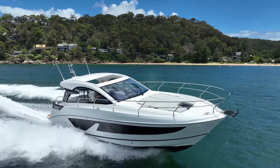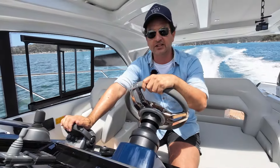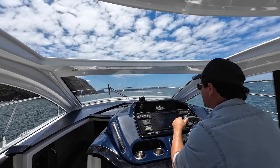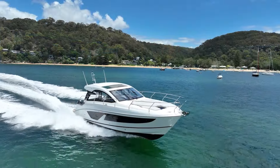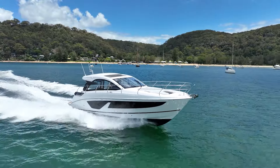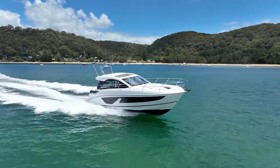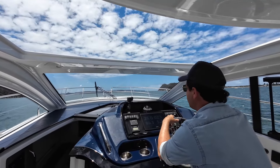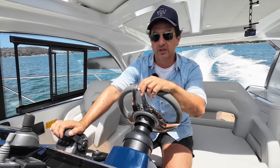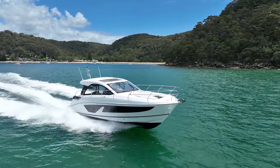I'm still doing this from the seated position. Let's increase the speed. From 23 knots at 70 litres total, I'm now getting up to 3,060 revs — let's get it to 3,100. It's summer holidays so you'll see my head moving all the time with people coming from all directions. That's giving me a speed of 26 knots. I'm at 3,150 RPM — 26 knots. Let's go to 3,200 revs, 80 litres fuel flow — 3,200 revs, just touching 27 knots.